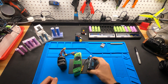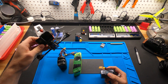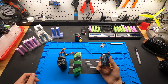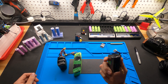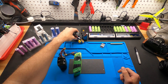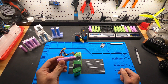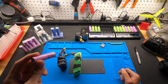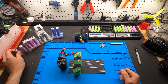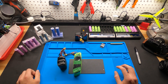I've done 4S packs and flying the Dave C frame you can get 30 minutes no problem. On the VT6, the cutoff is about 2.8 volts, so you won't be able to fly those cells as long as the 30Qs. The 30Q cutoff is about 2.2 volts, so if you really want to go extra long, you can take them all the way down to 2.2 volts per cell and fly for a pretty long time.